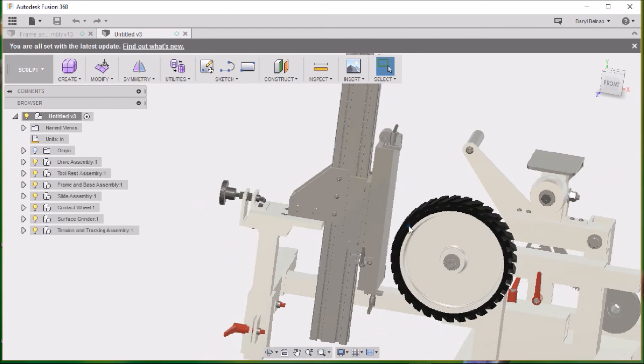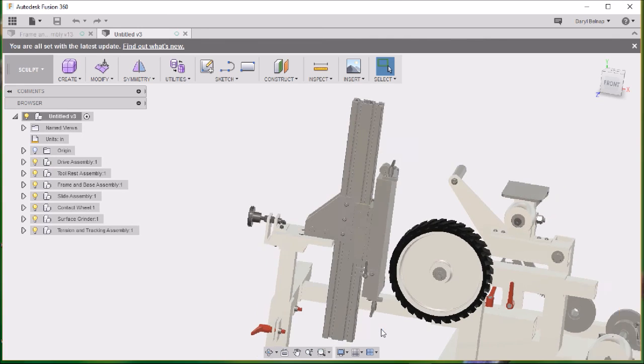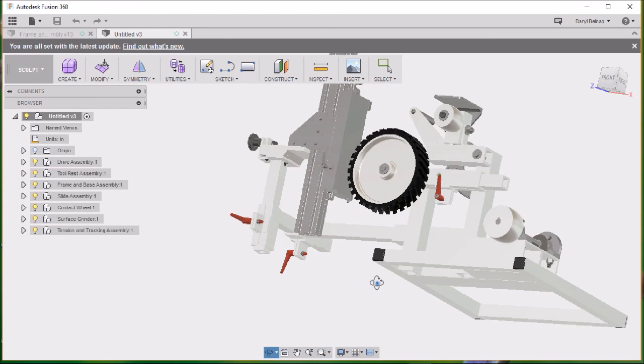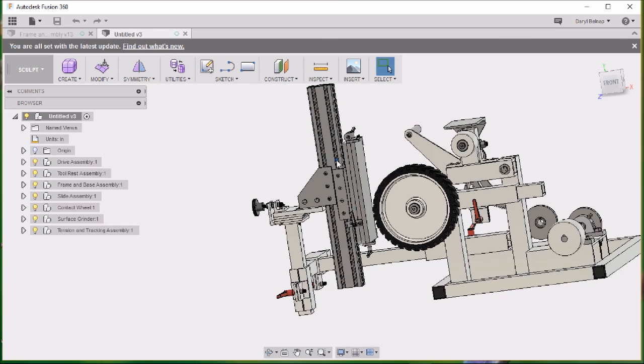Anyway, this is going to be a surface grinder, so you can grind the thickness of your blade. And by having it tilt out, and then this table mechanism sliding up and down, you can do tapered bevels. I mean tapered, like tapered tangs. You can do a distal bevel on your blade. So there's quite a few possibilities there, and probably some more that I haven't thought about. Once I get into it, I'll start seeing what its capabilities really are.